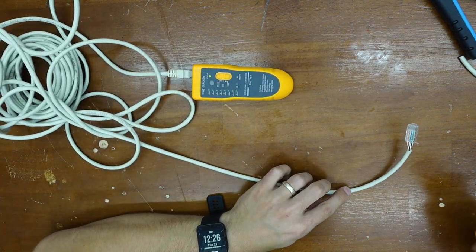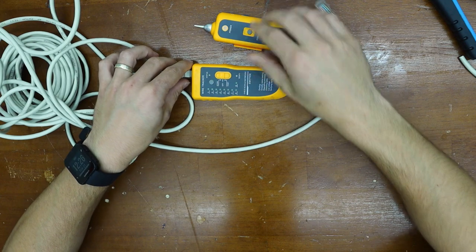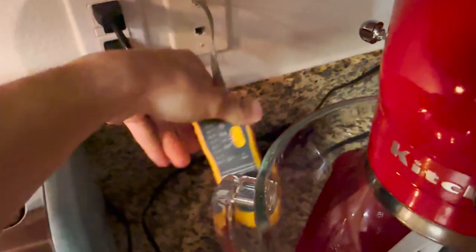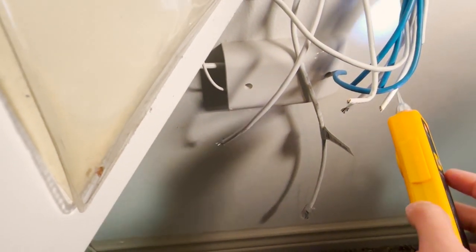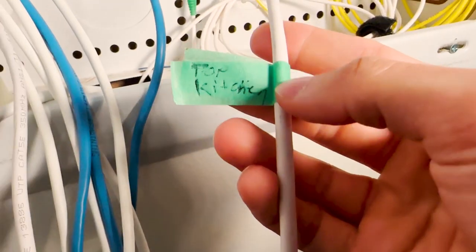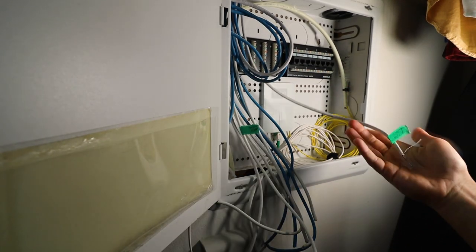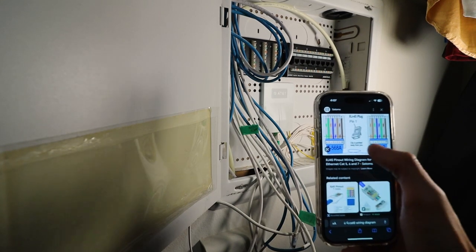The scanning I'm talking about is this — pretty nifty. Step one is to figure out which ethernet outlet you want to use. Plug in the ethernet tester, slide up to scan, bring the tracker to the control box, turn it on, and start tracing the wires. The noise will start to get louder as you get closer to the correct wire. I found it and just double checked. I separated it from all the rest of the wires, did the test again — redundancy. Go ahead and label the wire; for me it's 'top kitchen.' Before you start wiring, look up the diagram and figure out which RJ45 orientation you might have in your house.